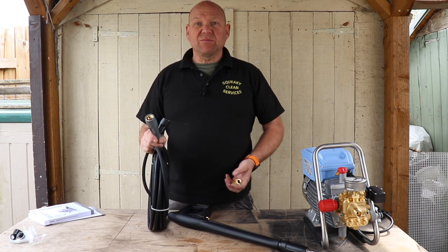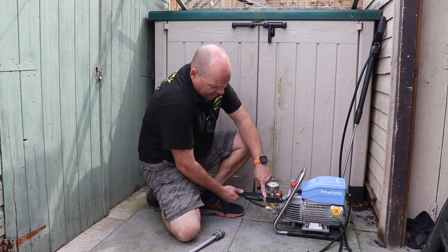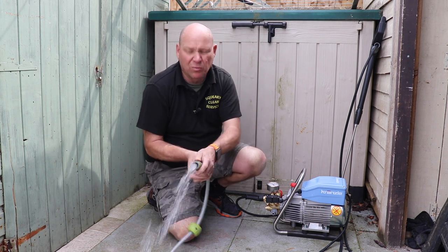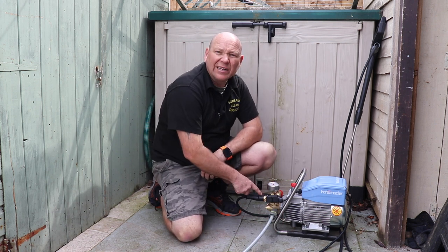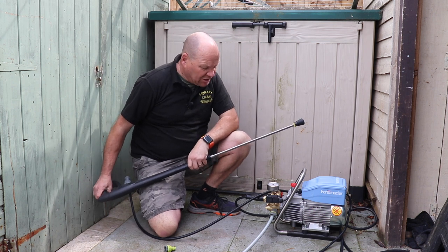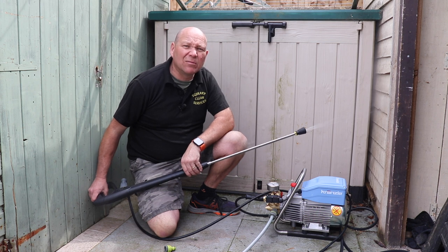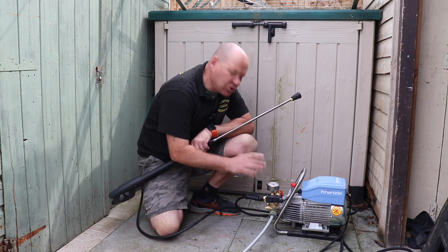Let's start it up and see how it performs. Before you turn your pressure washer on, you want to make sure you're not getting any air inside your pump. With your hose attached to your gun and to your pressure washer, first get your garden hose — this one's got a water stop on it — just to make sure the water's coming through. Once you know the hose is full and hasn't got air blocks in it, plug it into your pressure washer. Now turn your gun on — you'll hear air coming out, then you see the water start to run. Wait until all the air has come out. If you leave air in the pump it causes something called cavitation, which stops it from sucking properly.